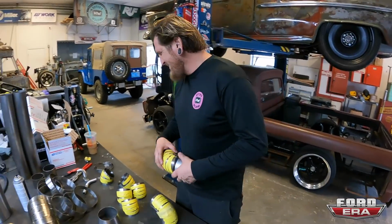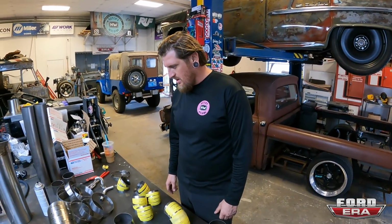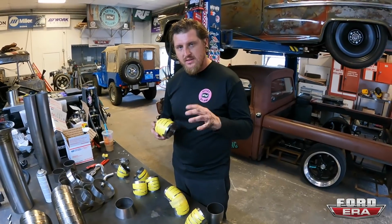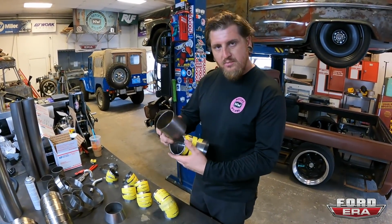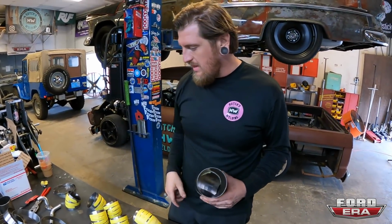So what exactly are you doing now? Just we'll show them a little bit, and then I gotta go, so you'll keep telling them. Yeah. So I'm fabbing up the downpipe right now. That's kind of a tight spot. I'm trying to clock these pieces in the correct order, figuring out my straights and getting a bunch of mock-up pieces, and we can show you some of that over there. And we're working on a big old intake. Kyle's welding that up.